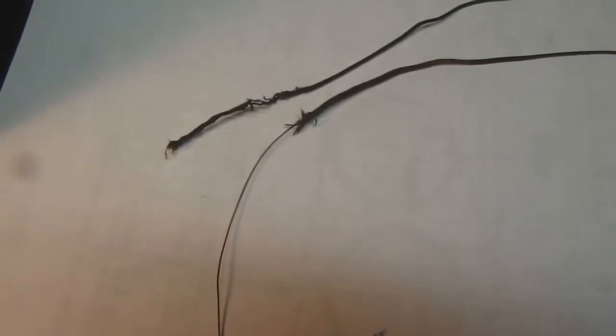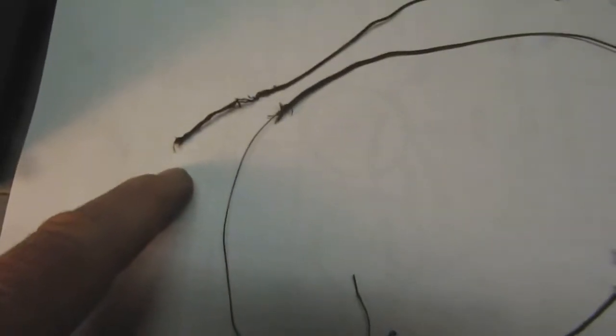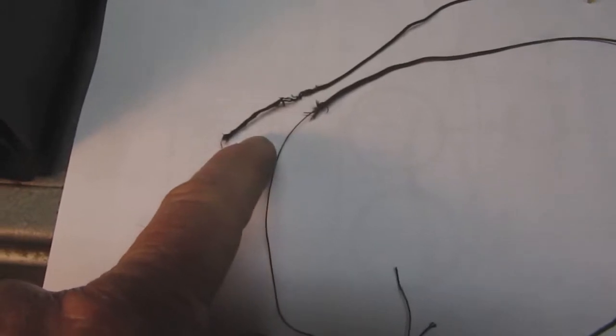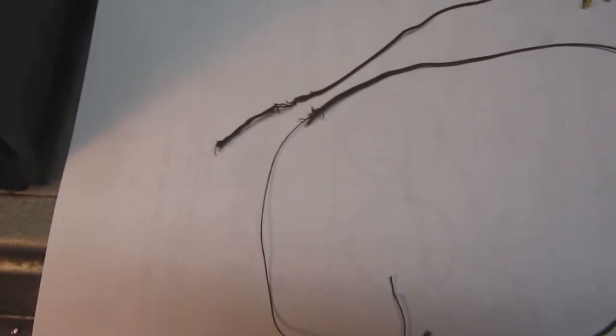Okay, I finished restringing the band spread dial cord. But before I show you that, I want to show you just how messed up the original dial cord was. This stuff was shredded. It's amazing. It was actually moving the band spread dial at least part of the way down the track there. But look at that. It was just binding. And part of this stuff was getting in the pulley and just shredding. It was bad. Very bad.